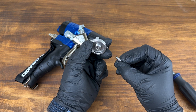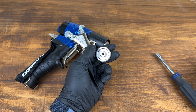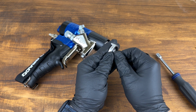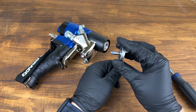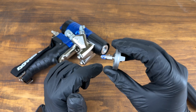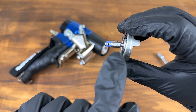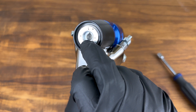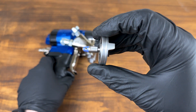When changing to another mixing chamber, I put it in lefty-tighty — a bit strange, but there's a reason for it. Once the mixing chamber is free-floating, we talk about how it gets oriented. You'll notice a little piece at the top intended to help you line the mixing chamber up, because inside we have these ports — little black ports on either side — that meet up with our impingement ports.